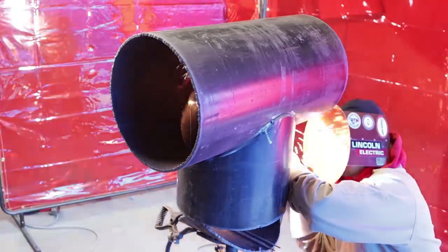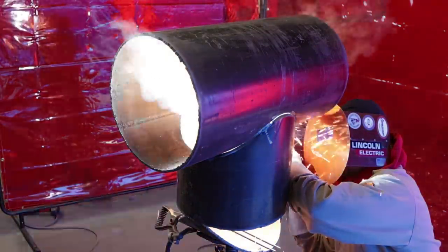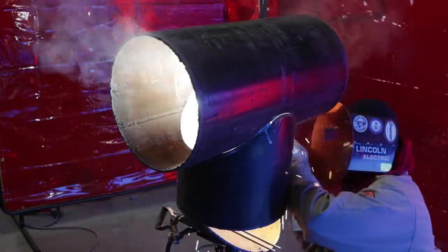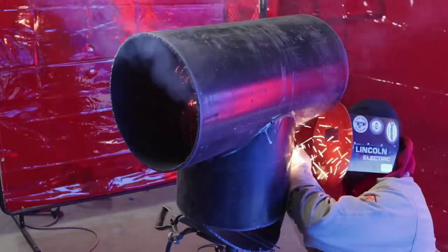But you always want to do your root on the throats first. Those are the hardest side. Get both throats, okay? Here I'm getting the other side. Same thing, just drag it. But like I said, depending on your fit, try to make the best fit possible. Right here, I just dragged it, maybe whipped it a little bit, just a mixture of both.